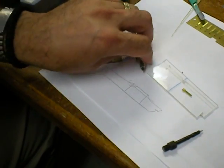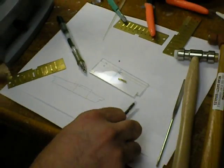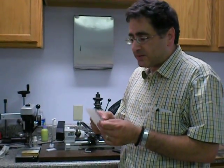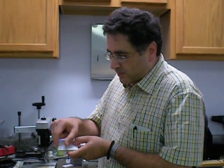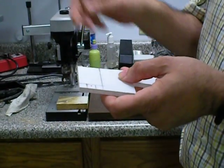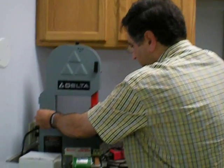You need to either smush it down with another punch and a hammer, or just take a file and make sure it's perfectly flat. I'd like to show you really quickly how we can make an inexpensive one of these. I have a piece of plexiglass — it's about a quarter inch. You can really use any scrap of plastic as long as it's relatively hard. It's always good to lay out your work in advance, so I made a strip that's about two inches long, one inch wide, and I marked where the recess is. I'm going to go over to the bandsaw and just cut that into a base piece.